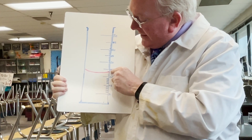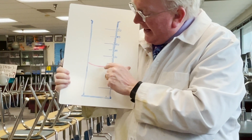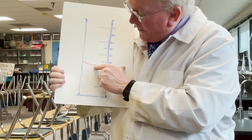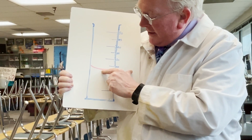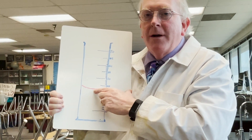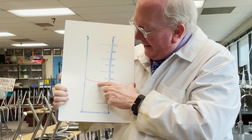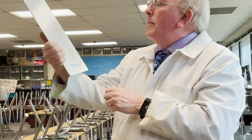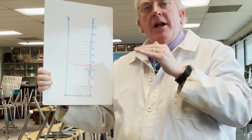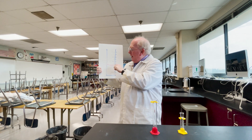Here it's hitting at 24, but that curves down, so it looks to be hitting at just about 23. It is possible that if that falls between two lines, you can estimate a half milliliter. This looks like it is 23 milliliters — if I got up closer on an actual piece of glassware, I could confirm it was 23 and not 23.5, but this one looks pretty solidly like 23.